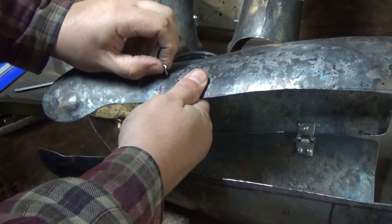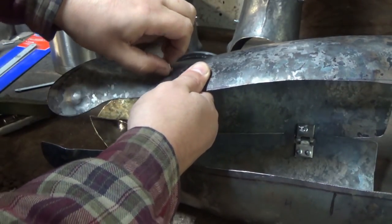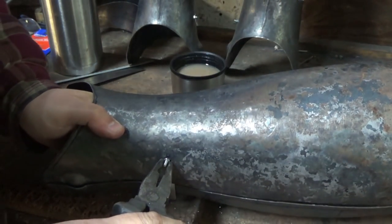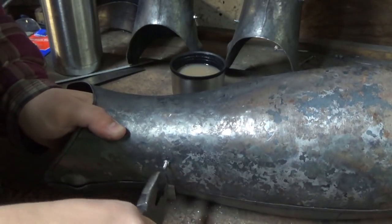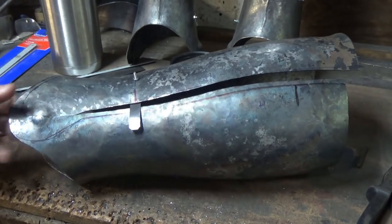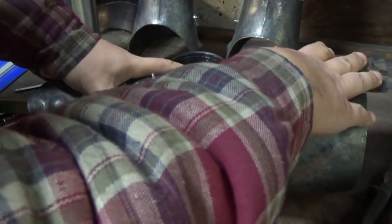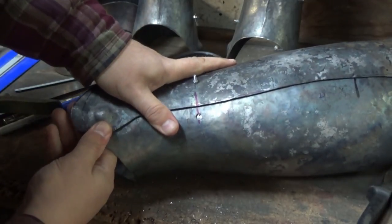You can see these aren't that difficult to get accurate — you just need to take time and think about the order you're doing things in before you do them. That's the bit I've found has changed the most over the years: trying to see the end and work back from there. Just tighten it up — it doesn't have to be too tight, but equally you don't want it flapping in the wind, because we need to know where this hole is. Pop it under, get everything set up as squarely as you can — there we go, that's where I want it to hold.